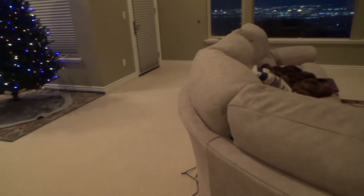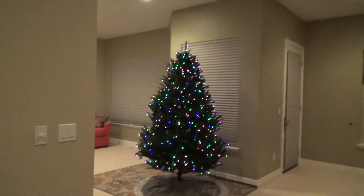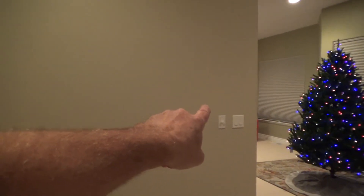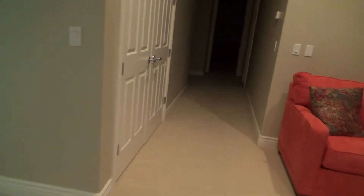That's probably another 30, 35, or 40 more feet of wire right there. Then upstairs, my mother's room — when she comes to visit — I'm going to install a ceiling fan. I've determined that circuit is on a 15-amp breaker, so I can use my 14-2 wire. I'll go from the light switch up and across, and I'll need another 20 feet of wire there.